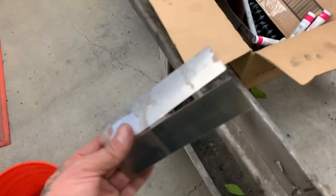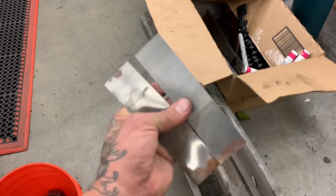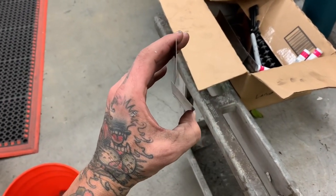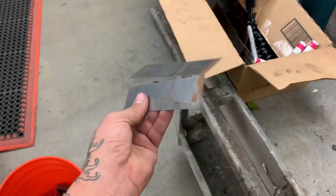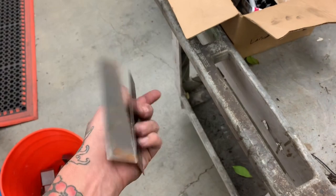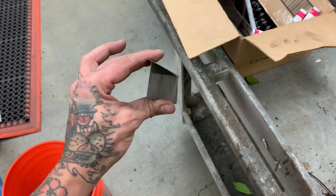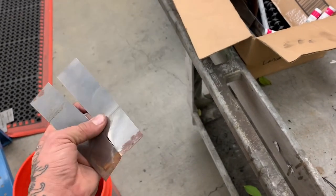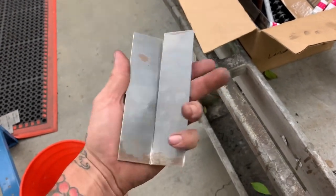I did chop up some thin 1095. Here's another pro tip: some of us want to make medium count, low count, and high count damascus. Well, a lot of steel suppliers will sell this in maybe eighth-inch thick at the thinnest for 1095, but if you go to Admiral Steel you can order shim stock.